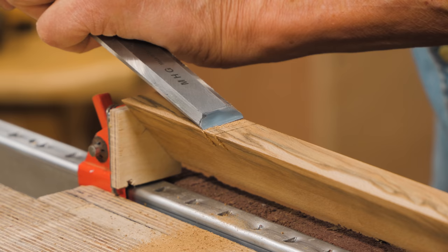We use a square to get the 90 degrees we want, going to the top of the ridge. You can go directly to that ridge. The same on this side — getting the internal corner lined up with the fore edge, inside corner of my square. I'll put a mark here and a mark here, because having planed that front edge I may not be parallel. Looks as though I'm fine, but I may not be.